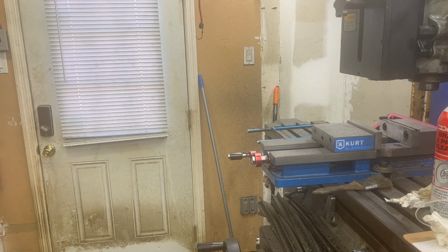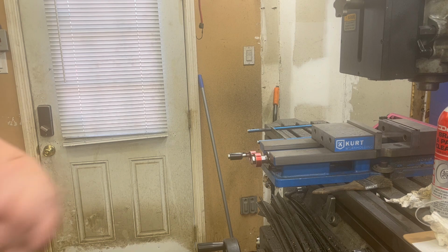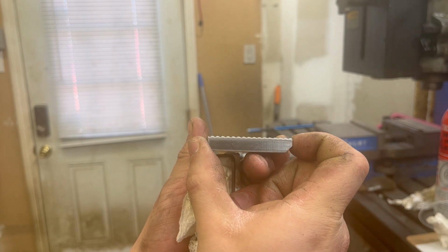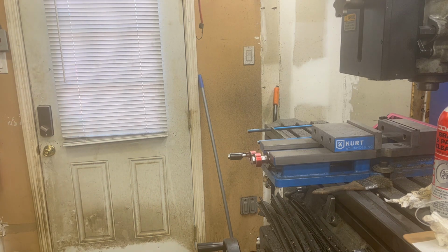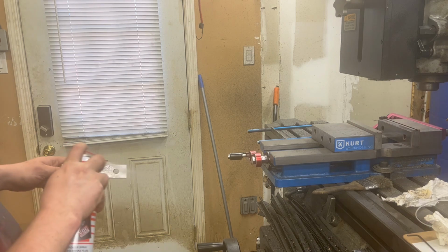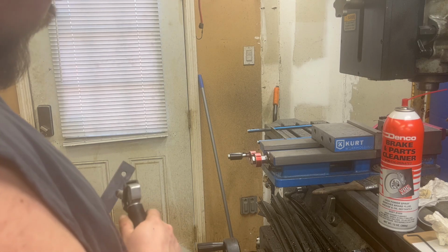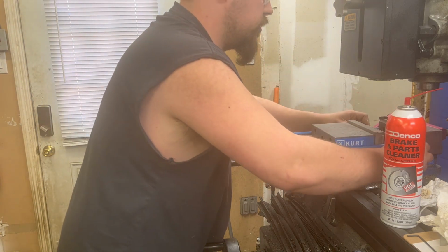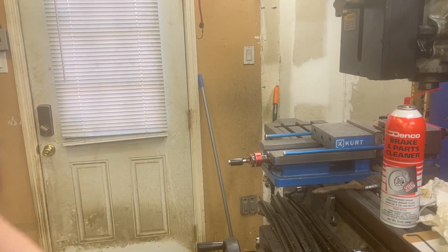If I drop this one more time, we're going to chuck it in the woods. I'm going to go buy some new ones. Trying to hold this jaw. I need to clamp it on that flat face. 1.5 inches. Let's take a 1/16 out of it. Help me do the math. 1 7/16. And I don't have any. I've got a parallel keeper on this vise too. They're that handy. Please get yourself one. You're really stressing me out.